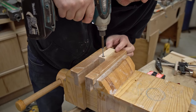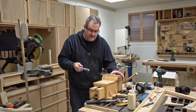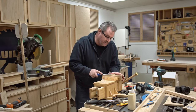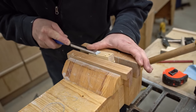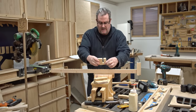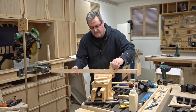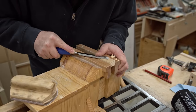As for that bevel, normally I'd take it to my sander, but there's too much junk over there to set the camera up, so I'm going to do it old school with a chisel — just shave it down and then do a little hand sanding to smooth it out. This bevel doesn't need to be super accurate, it's just for clearance. The purpose of the taper is so that when you adjust the clamp, you can tilt it forward so the piece of steel that sticks down will clear the notches as it slides back and forth. There's a corresponding bevel on the bottom piece as well, except it's on the rear.